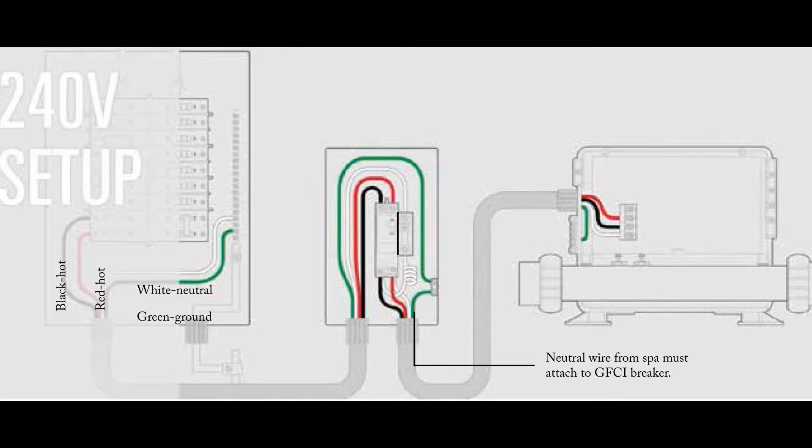In order for all this to work properly, the neutral has to run through the GFCI breaker. That's why the 240 volt GFCI disconnects come with a neutral pigtail that has to be connected to the neutral coming from the main panel. It also has a terminal where the neutral going to the equipment must be attached. In that way, the neutral wire comes from the main panel to a terminal strip in the GFCI box, and from there connects to the pigtail which goes to the GFCI breaker. Then from that terminal, a neutral wire goes from the GFCI to the equipment. One more thing about wiring that is often misunderstood: the neutral and ground wires are connected on the same terminal strip at the main panel service entrance, but that is the only place. At all subpanels, service breakers, outlets, and so on, the neutral is not connected to the ground.